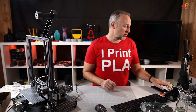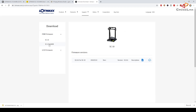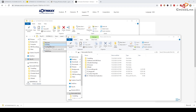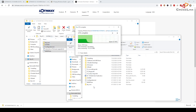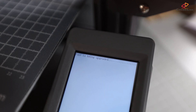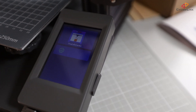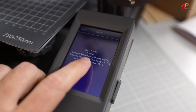On the Lotmax homepage under the support section you can download firmware. Selecting the SC10 Shark model, the latest version seems to be 0222. I unpacked the zip file, copied the files to the main directory of the SD card, inserted it into the printer, and powered on — it automatically upgrades the firmware. It's booting again with the new firmware; the firmware date is September 7, 2020.